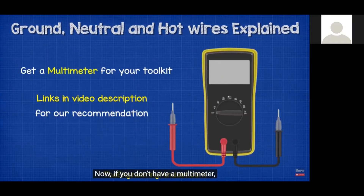Question: what is the best size for the ground fault wire and what is the best place to ground it? If you have access to go straight to a ground rod or can get a ground wire from an electrician, that's always best since they're the ones who ground the building. If not, shooting a screw into building steel like the red iron is always a good earth ground because they have that connected to multiple ground rods. They don't really like it when we tie to water pipes, even though those are great grounds too. As far as size: a roll of THHN from Home Depot, 12 or 14 gauge, is always big enough to handle the biggest power surges we deal with. If it's bigger than that, it'll fry the circuit anyway and no surge protector will protect it.